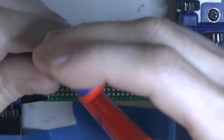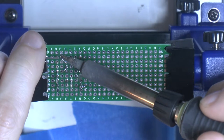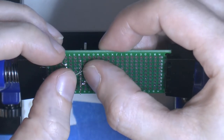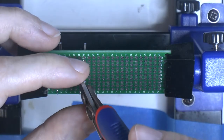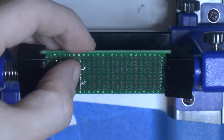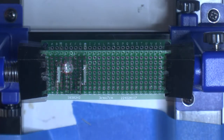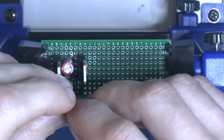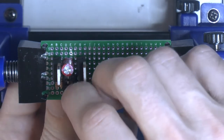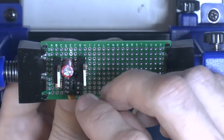I do like this Knipex cutter — it's really nice to get into tight places and cut wires. Worth spending a couple of euros on that one. That's the resistor for pin number three on the 555 timer, where we get our square wave coming out, going over to the transistors to get amplified before we send it off to the diodes and caps. This is a filtering cap — 100nF — which I found I needed from my oscilloscope measurements. It's quite common to have one next to your ICs. It reduced the very fine ripple to almost nothing.